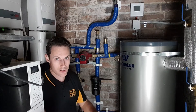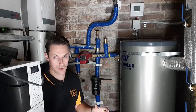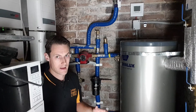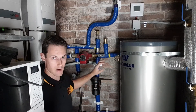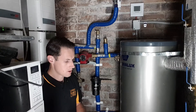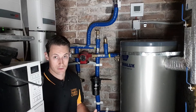Now, when you've got radiators on a hydronic heating system they're made of steel. Over time they corrode on the inside — they rust. The rust can lead to leaks in the system, and any corroded metal that dissolves into the water gets into the pumps, valves, and mechanical parts and causes problems. So what we do is dose the system with a chemical compound which stops it from corroding.